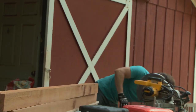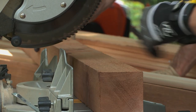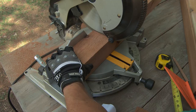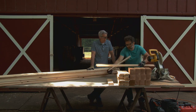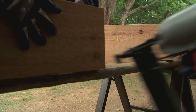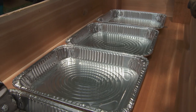Nothing complicated here for the lumber — just a 4x4, some lengths of 1x8, and a few 1x4s. Short pieces of 4x4 will be the interior corners of three shallow boxes that make up the worm bin. The big 4x4s provide the real structure for our boxes and give us something solid to drive long nails into for extra strength. The size of your boxes is up to you — ours measure about 4 feet by 20 inches — but make sure you make yours all exactly the same. Only the bottom box gets a true floor made up of 1x8 planks, and you can use it as a tray to capture the worm's liquid waste with some simple drip pans.